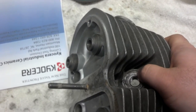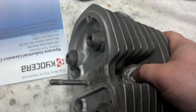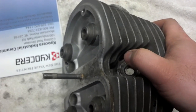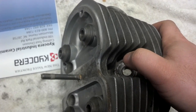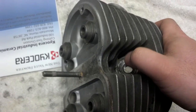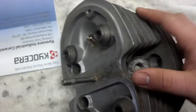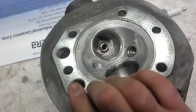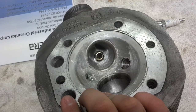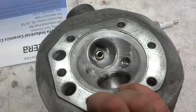You get your plate bolted down and angled to the correct angle, then center up on the tap and lock your table. I have a Starrett edge finder and a center finder — I use the center finder on the back of the tap to center up on it. Then once that's centered, all you have to do is unbolt your head, pull it off, flip it around and bolt it back down. You're at the exact perfect spot because this head is a mirror image of itself from one side to the other as far as the combustion chamber and bolt patterns are concerned.